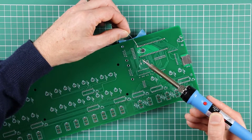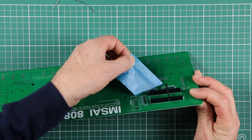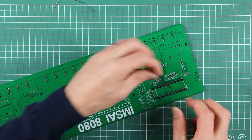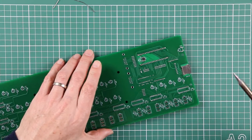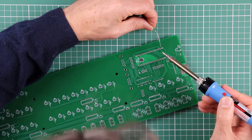Just soldering the pins at each end. Again, check that everything's okay. At this point, the two female connectors will be completely stable. We can remove that male pin header and just get on with the slightly tedious job of soldering up the remaining balance of the 40 pins.